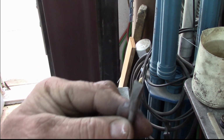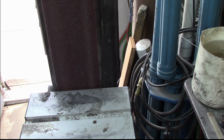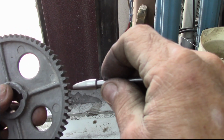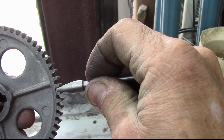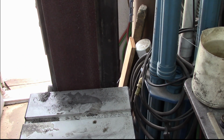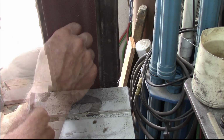Okay, let's start comparing that with a gear. See what that looks like. And I think we better stop right there when we compare it to the way it fits into a gear. Goes in there just like that. They call for a 3/64 radius on the end. I think we'll just see if we can't lightly do it, and then we'll finish it out by hand.